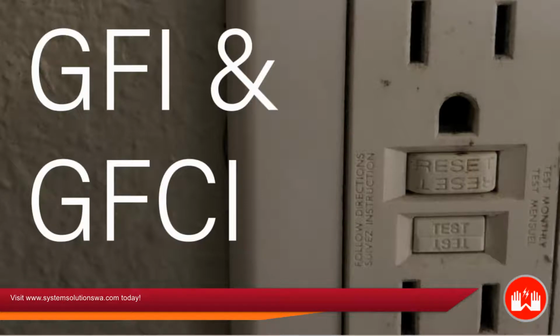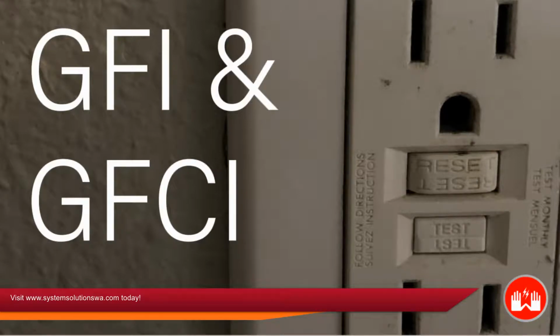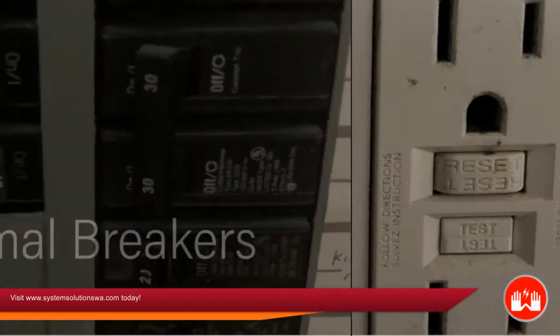Suppose you continue to have no power. Check your breaker panel. If the reset button does not reset, you may have a faulty GFI or an issue with the circuit or the appliance. A GFI is a crucial safety mechanism. If it is not working correctly, you need to call a certified electrician.